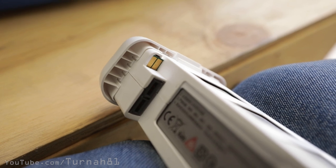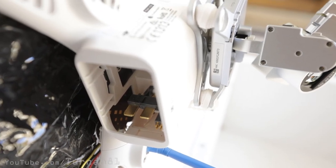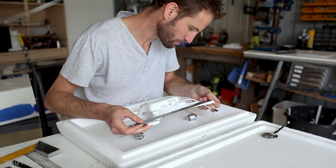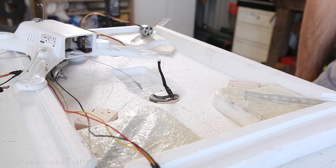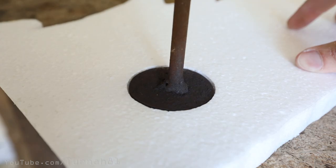There was a problem with this plan: the battery system is its own unique system and doesn't have terminals you can just connect together, so I had to bring back the bottom half of the drone's shell just to have the battery clips that clamp onto it. Also when working out the position of all the components I had to make sure all the centers were nicely marked out so everything balanced, because you don't want one motor working harder than another — it might overheat or explode. Most components went back in their original positions in the shell, which worked out pretty good, except the GPS sensor. The GPS sensor is at the top of the drone because the satellites are up in space, and there wasn't room with no top half of the shell, so I had to work out how to get it into the foam.